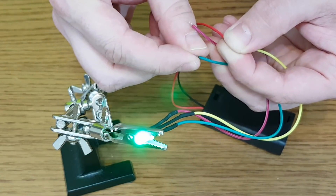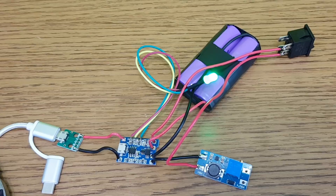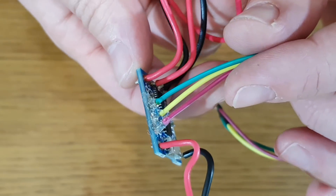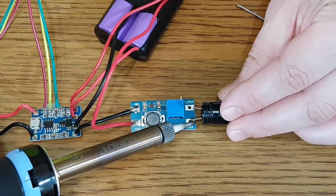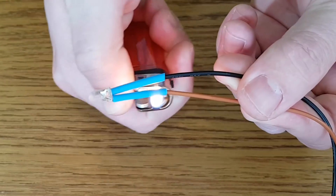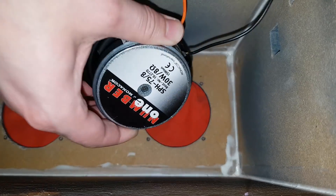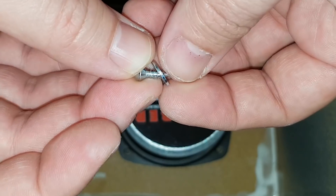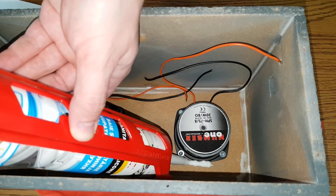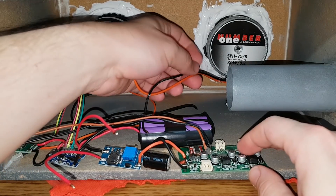Let's test it — red wire, green wire. When the battery is fully charged, the LED will turn green. I'll put some hot glue over the soldering joints as they are a bit fragile and may break when I move the components. The capacitor will be soldered directly to the step-up converter output. I'll replace the Bluetooth module's tiny LED with a 5mm blue LED. For the speaker drivers, I'll use tiny screws and washers to fix them on the front panel, then seal them with silicone sealer. Use some latex gloves or a simple plastic bag to spread the silicone around.